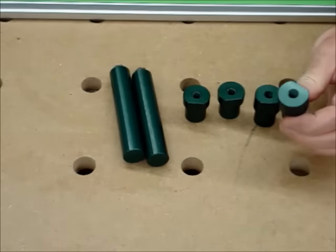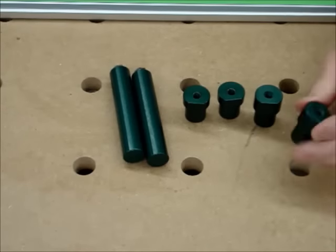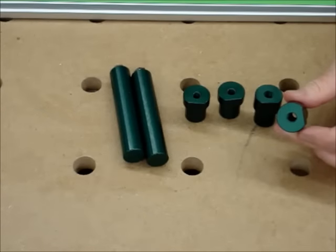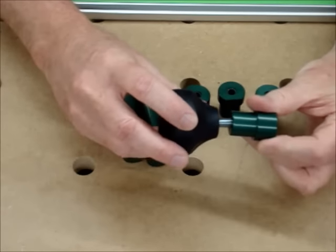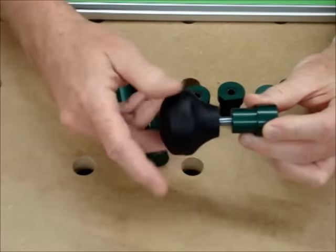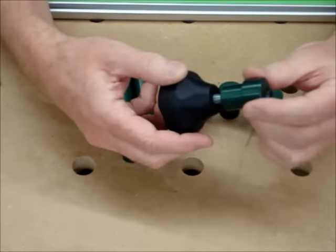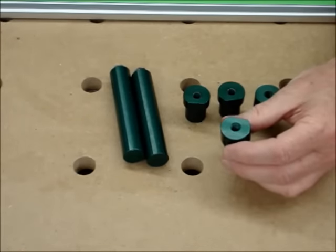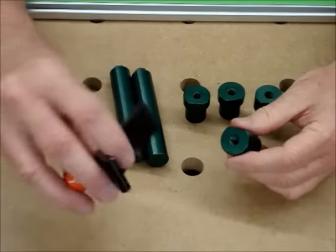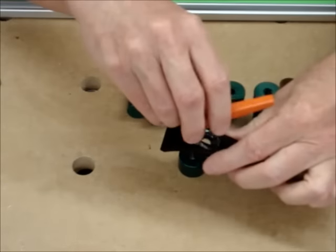If you prefer a round face, then you've got the round face option. And the third option is it has an 8 millimeter hole drilled and threaded all the way through the dog. With this M8 thread, it enables you to use the Festool clamping knobs or other 8 millimeter knobs, and you can clamp the dog securely from the underside of your MFT table.